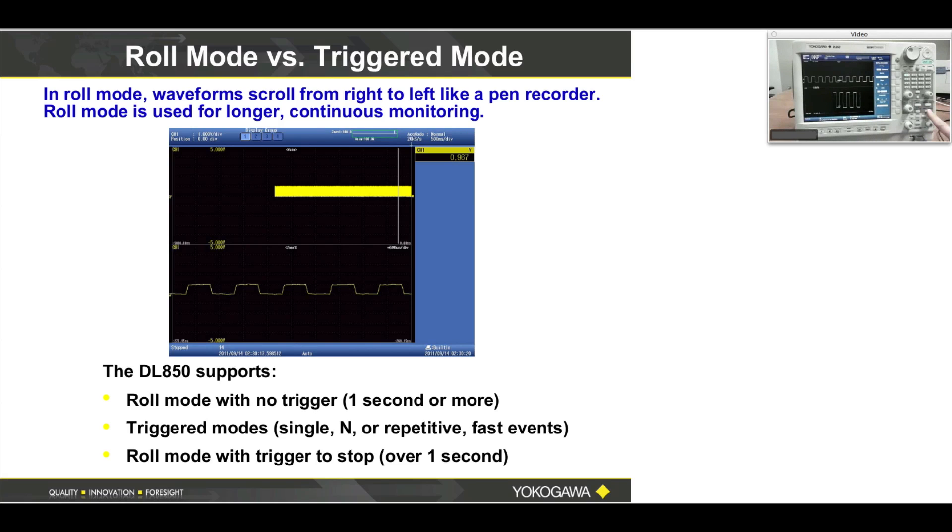This is very important. Soft Menu button number two tells me the channel of your trigger — that must be the waveform that you're putting in. So most of us are on channel one. Please set your source to the same channel number that you have your waveform sourced into. So if you're going into channel three, set this for channel three. That's a normal trigger.